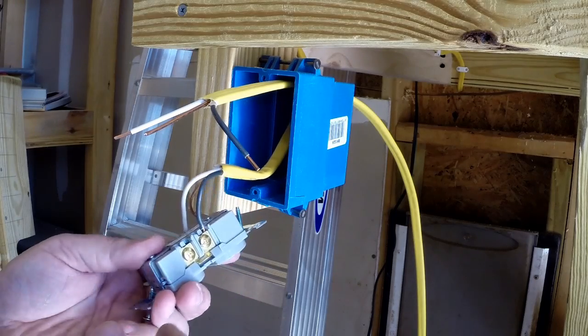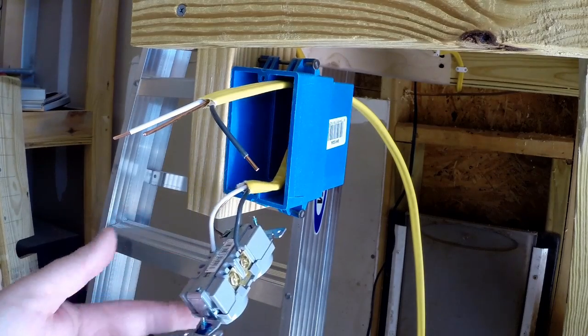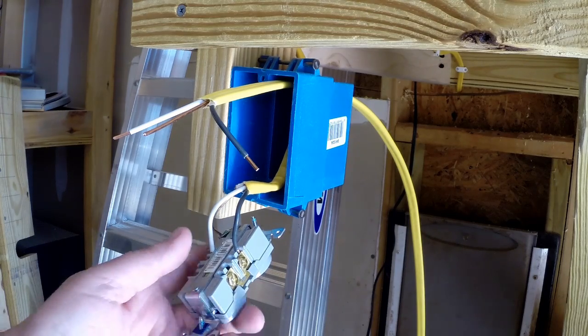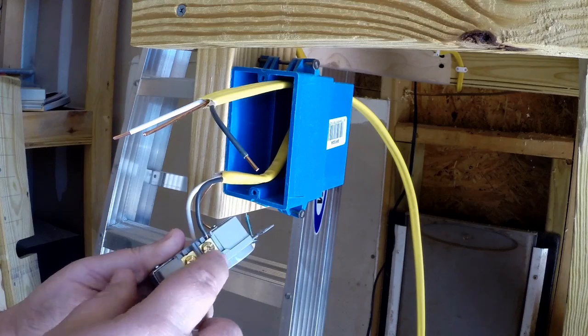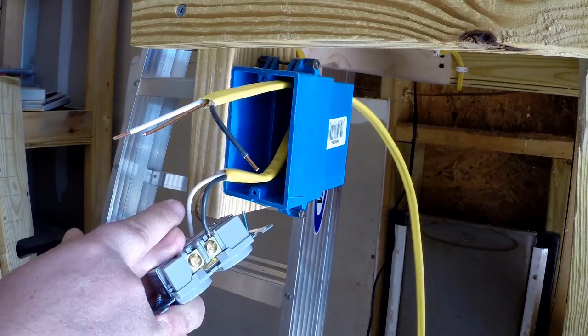Alright. As you wire in the outlet, same color goes to the same side. You've probably seen some outlets in your house where a light switch controls one outlet, then the other outlet's always hot. That's done by clipping these lines right here. Right now, since those aren't clipped and that's solid in between these two contacts, that means both these outlets are being powered off this one pair.